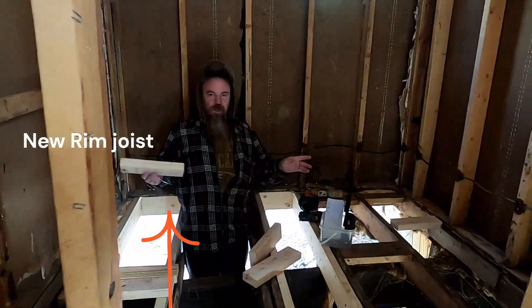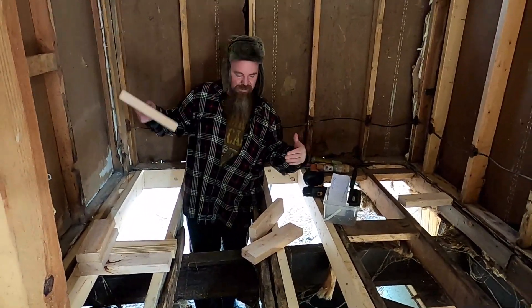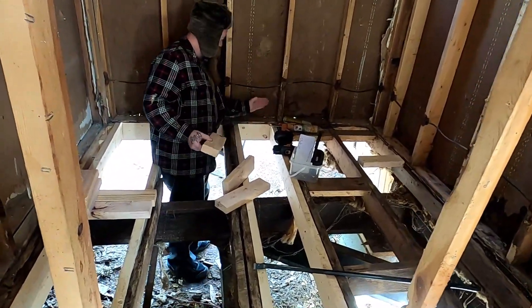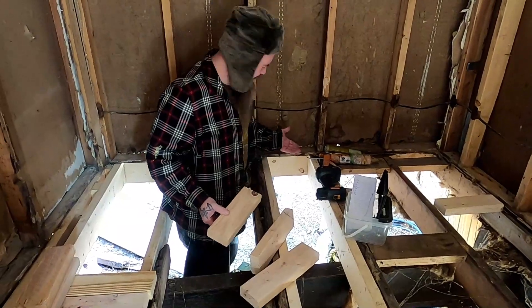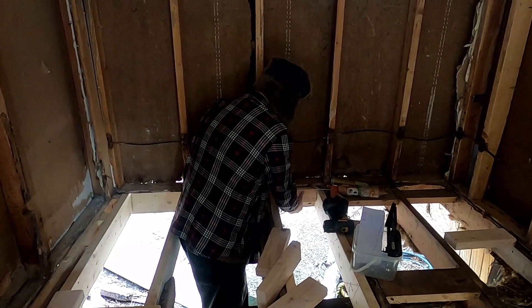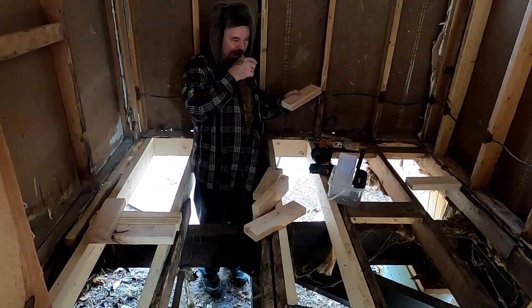Because of the way I figured out I'm going to put the decking and the plywood down, I'm going to run the seam this way - it'll come out four feet this way. We have a full sheet, then it'll go across and be a seam, and then the other chunk will go over here. Since there's going to be a seam I'm going to have blocking in between. I need some blocking out here too because where I put my plywood, sure it can span the gap, but there isn't anything right there - if you put your weight down you might feel a little flexing. So I'm going to put a block across all of these, whichever one fits, to make it tighter so that everything sits on something. The plywood will sit flat on everything. I have a whole bunch of little blocks to measure and cut, so I'm going to install all of these.